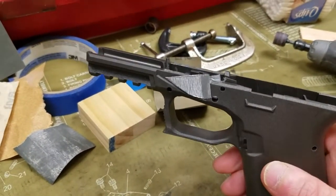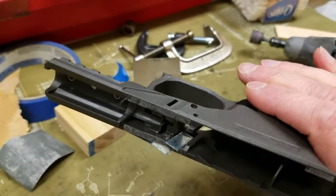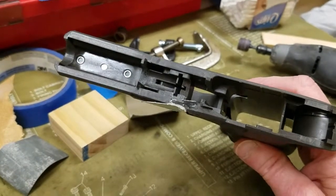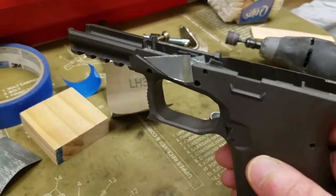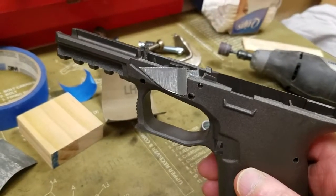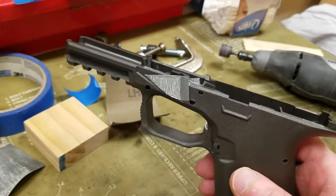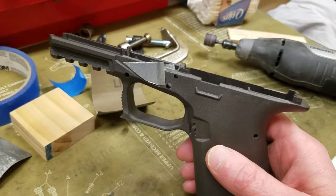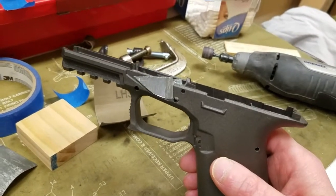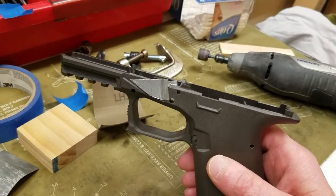So you can see I removed the two C-clamps and the Dremel sanding wheel that was holding the inner piece of metal. I didn't really need to fill that in, I was just trying to do a little extra. The main part was this little chunk in the front here. There's a bend I made that replicates the molded-in contour at that location. What I did was I tried to move the frame in its jig laterally relative to the end mill instead of just moving it laterally and then plunging down, so the mill bounced around a little bit and took a little chunk out of the top — what would be under the slide, the top of the frame.